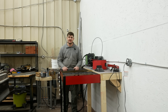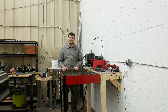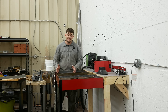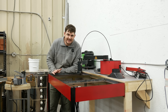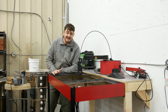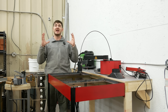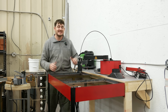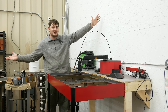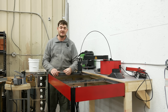The two most common types of fume extraction or collection are a water table or a downdraft table. In researching for this video, I tried to look up which one is best, and what I found was a lot of plasma cutter enthusiasts yelling at each other. Y'all need to get a grip. Neither one is perfect. I chose to go with a downdraft table simply because this thing folds down — much easier to do that if I don't have to drain out the water first. But I don't like the way a lot of these downdraft tables are implemented. What I've typically seen is the table is a big open hole, and at the bottom are a couple of gigantic fans that will suck out all of the fumes, but also all of the air in the room. And this is conditioned space — it's heated right now, and in the summer it's air conditioned — so having a big open hole with fans at the bottom seems needlessly inefficient.